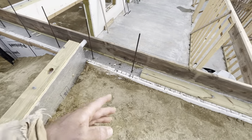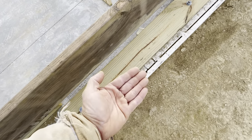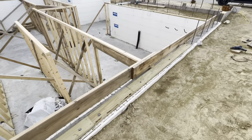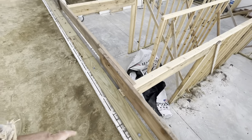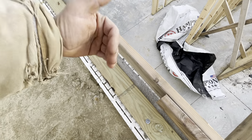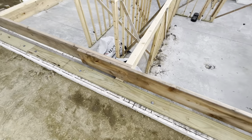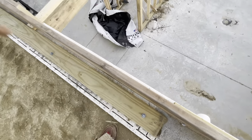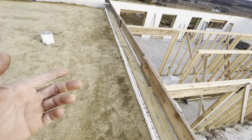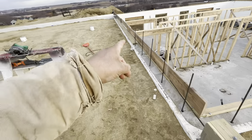So you can kind of start seeing now - this is poured concrete to there. There'll be another floor joist here, but it's going to be green treat because the dirt's going to go up to it after we put a waterproof barrier against it. That has to be green treat through here because this is a wood framed wall. We decided to throw this one in just to make flooring because it doesn't really need a floor joist there, but if the layout on the floor was weird we're covered. Originally it was going to end here and come around, but since we didn't have the right wood, this is all leftover from the plank system. We're using the less good wood on the box sill because there's not a lot of span in the box sill - i.e., no span.